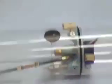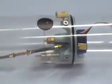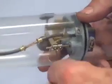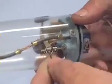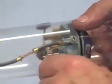You move these collectively forward or aft to either achieve more blow or more vent. That operation is achieved by engaging the wheel collar set screws with an Allen wrench. In this case, we're moving both wheel collars forward a sixteenth of an inch — moving the ballast arm forward gives us more vent and less blow.